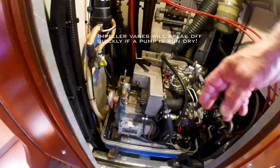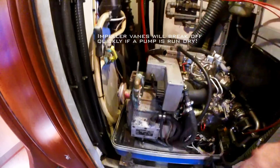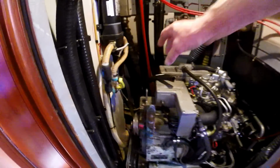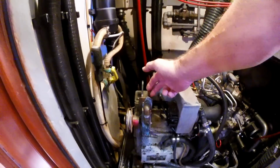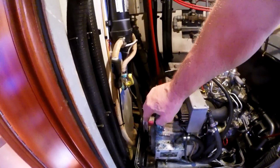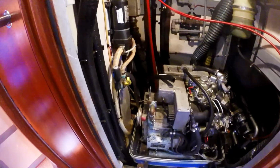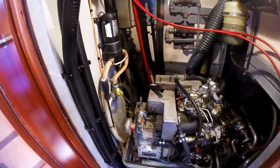I've got a new impeller. I've got new sealant on this, and we're waiting on belts. Somebody had unbolted the bolts and twisted this lifting bracket, which is also the bracket for the pump, in order to use a smaller belt. But it meant that the pulleys were misaligned. So when I put the alignment back, it ended up being that the belts that we had didn't fit anymore.